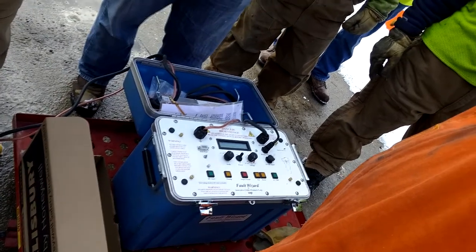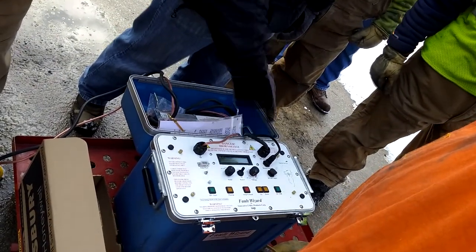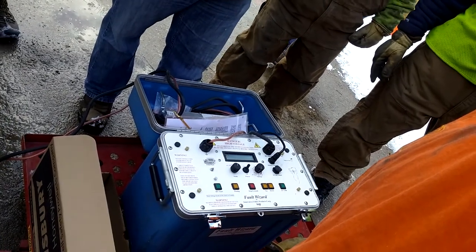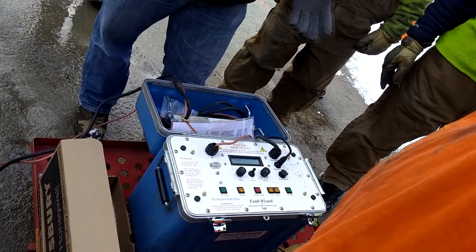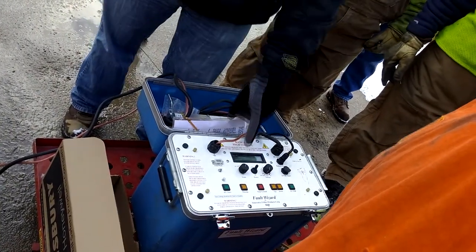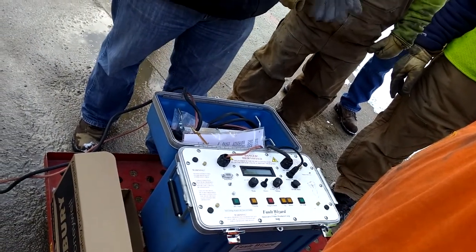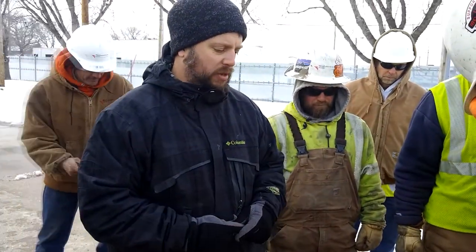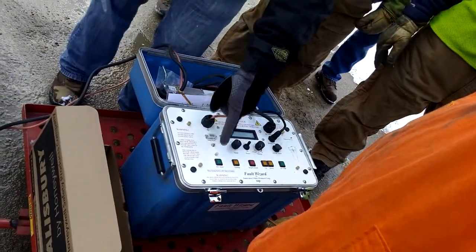If you get an RF reading, you may thump it two or three times and come up with a different footage each time. Go to the other end and shoot it that way — you'll get a better reading. You also have your velocity of propagation reading, which is the percentage of the speed of light. Every cable has a different speed and most cables you're going to be on are at 54-55%. When you're high-potting, none of that really matters — just your output voltage matters. Go ahead and hit HV start.